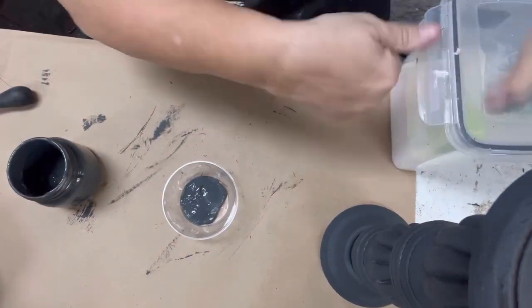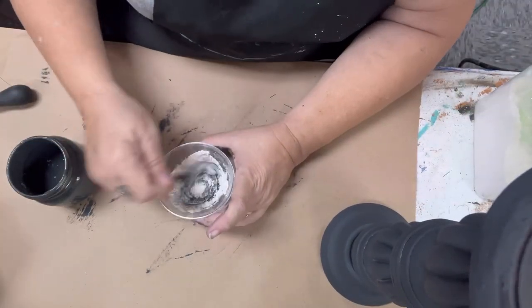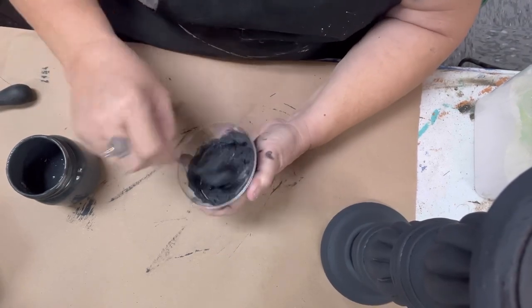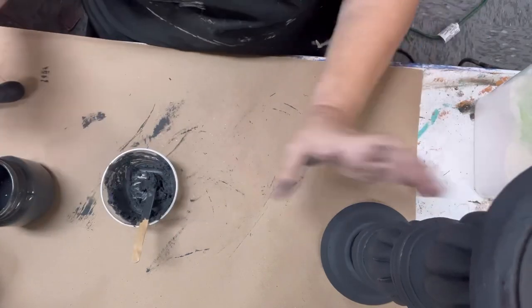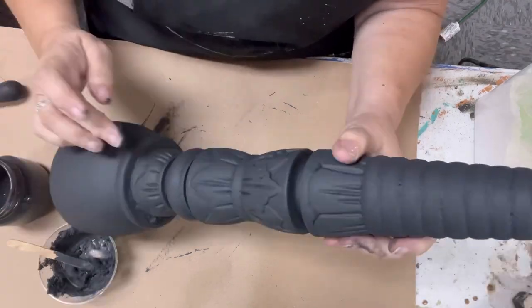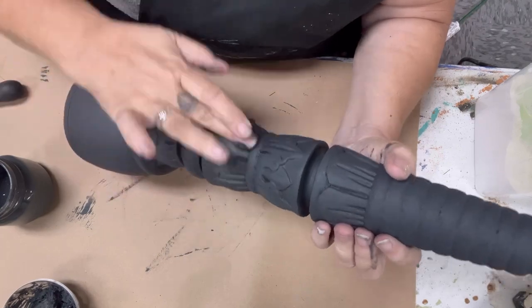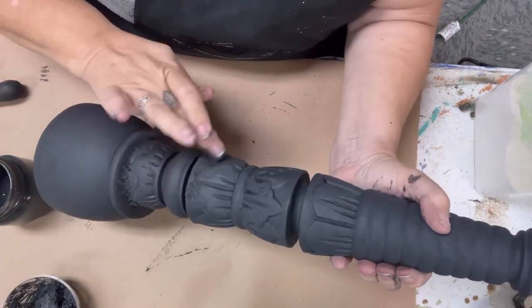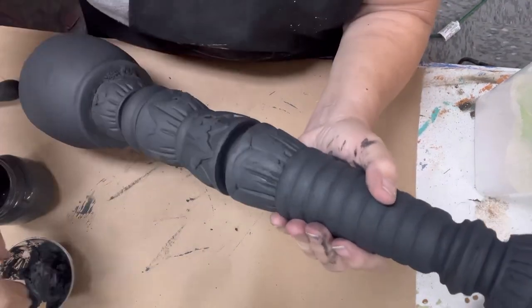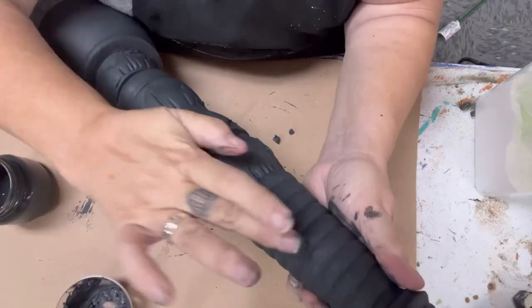I wanted to try something new. So I've started with base painting each of them with one coat of Dixie Belle's Black Sands — that is a silk all-in-one — and on the second coat I'm mixing in a texture medium. A texture medium is like salt wash, sea spray, or fusion fresco. In this case I've mixed it really thick and I'm applying it with my fingertips because I want this part to be kind of caked on. I want it to be thick and crack, so I'm going into some of the deeper grooved areas and applying a lot.